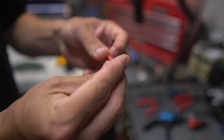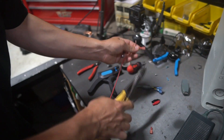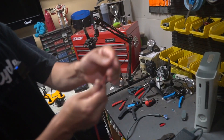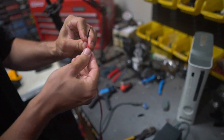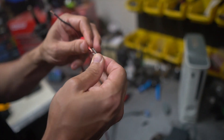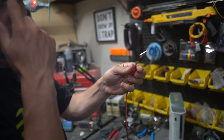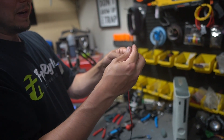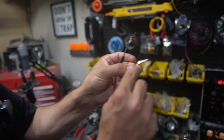This is the wire I'm going to add to it, so let me crimp the connectors onto it as well. We're going to add some alligator clips. On these wires, I have them cut at different sections so that the chances of these things bridging - like I just did like a dumb ass a second ago - hopefully isn't going to happen later. I don't really like these little silicone covers. That could still totally touch itself. I'm actually going to solder this connection on there because these things break pretty often, but just on that side so that it can still maintain flexibility.